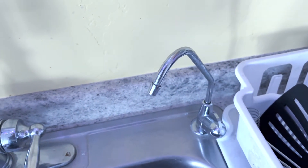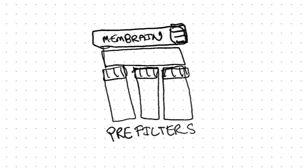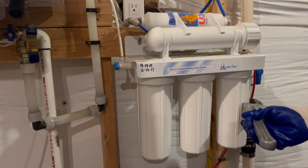Your system should be drained down to where you can start working on the filters. Most reverse osmosis systems are actually a series of filters — the membrane being the most important one. It does all of the thorough cleaning, but to protect the membrane and help it last longer, there are a series of pre-filters. These are usually what need to be changed annually, and that helps the membrane last up to 10 years.